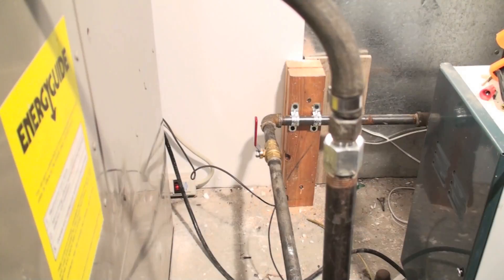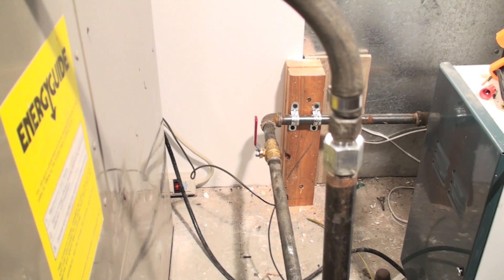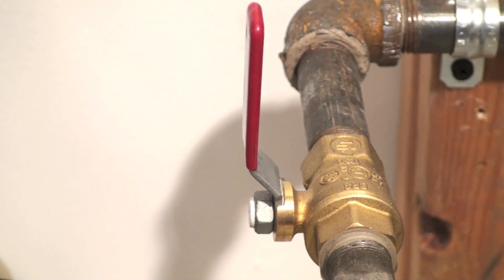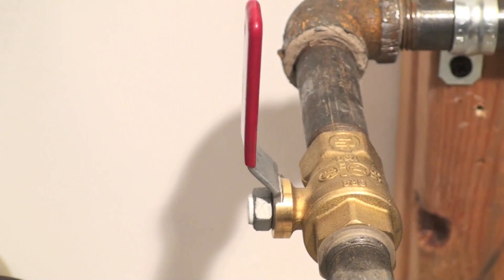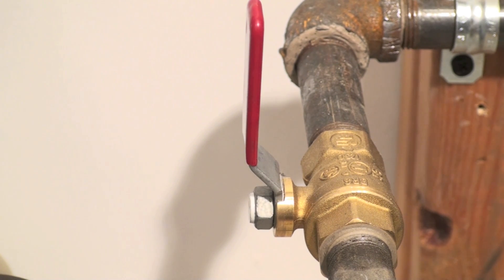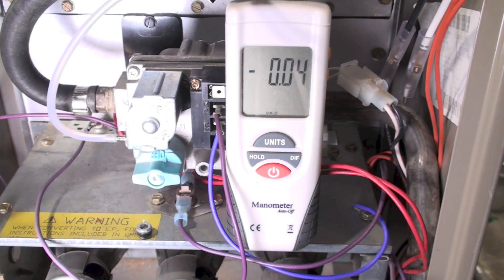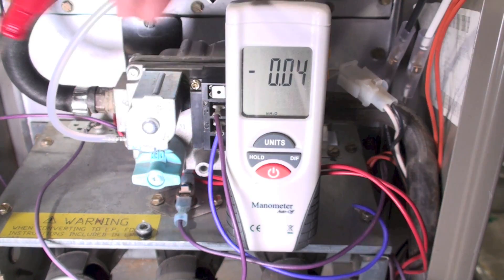Remember: if you're doing gas input — from the gas line to the gas valve — before you remove the plug, shut off the valve. The valve should be crossways of the pipe; that's your gas cock. There's a gas cock usually within two or three feet of the appliance. Shut that off first, otherwise you're going to get gas pouring out.